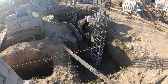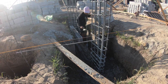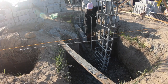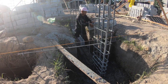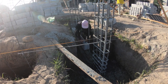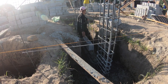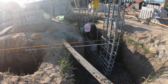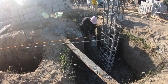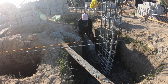The way they work on these foundation walls: they put in mortar mix on the base that they poured yesterday, and they'll lower the hollow block over the upright rebars as they come in, placing it down into the mix — using it more like mortar, like you're doing bricks on the side of your house, except these are going on the foundation wall. They make sure it's in line, then come back later and fill in the holes with more of the same mix or a slightly stronger one. They've actually got another batch of hand-mixed concrete to fill the holes with.